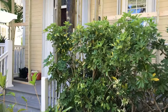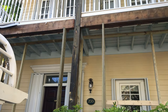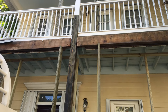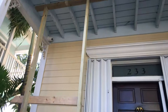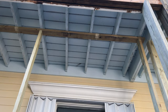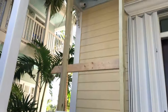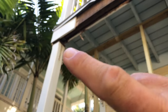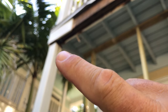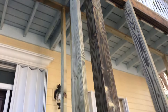Welcome back. This is how you repair a rotten six by six post on your house. Basically you've got to shore it up first — shore up the existing structure with some two by fours. Right here, these are the old six by six posts. It was all decayed and rotted on the top part. On this one, it was just replaced, and instead of replacing the entire post...